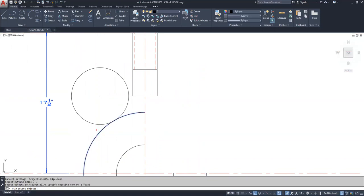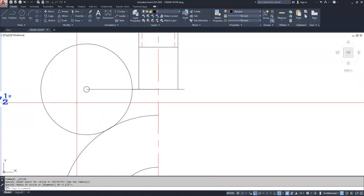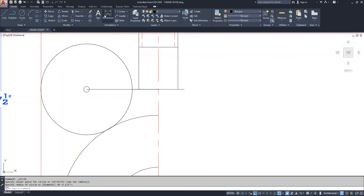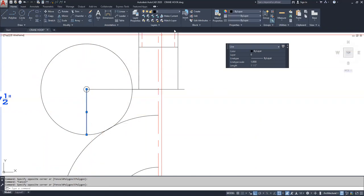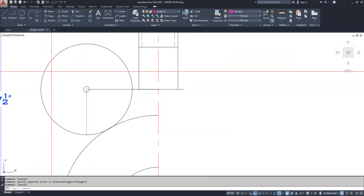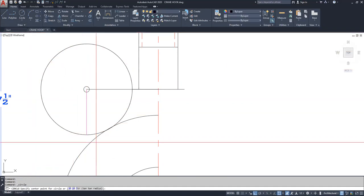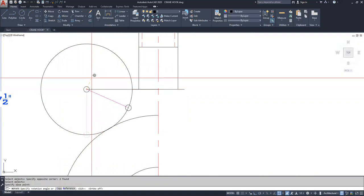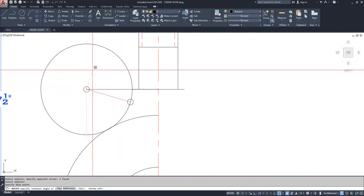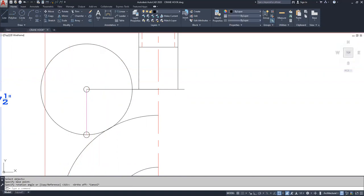So what you could do is erase that arc. So what does that mean? What did I just do? Well, if you were drawing this by hand, where I just put that circle is where your needle is going to be, needle of your compass. And you have a line that's 3.5 inches long. So let's imagine that this pink line is how long you're spreading your compass. There's the needle and there's the lead at the end. And you're rotating it along here like such to draw your arc. So you don't know where it exactly stops or ends, but you draw enough of an arc. Let me show you.